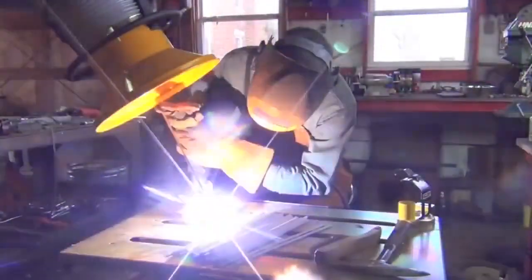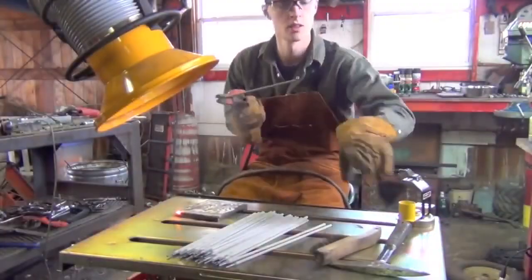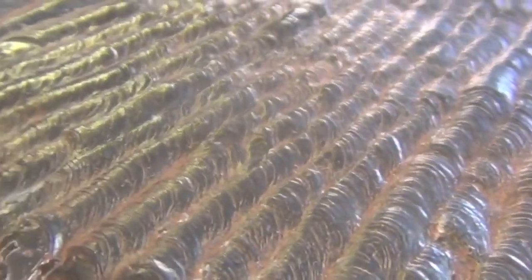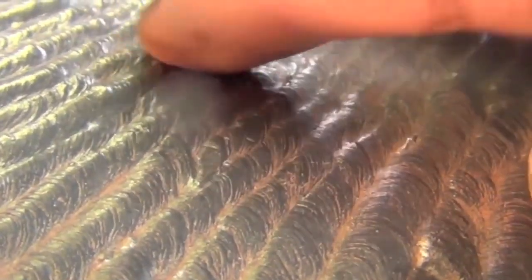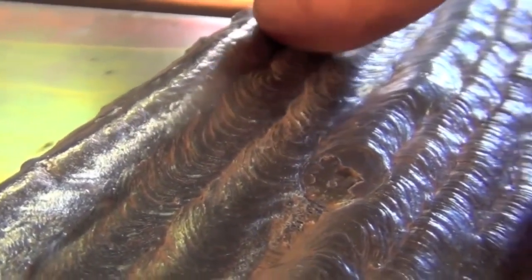Let's do it! So now our nice buttering layer — pad of beads — is finally done. I cleaned it up and let it cool off. If you look over most of this, you'll notice across the top it's all nice and smooth with not a lot of rippling effect, which indicates about the proper amount of overlap. Down here on the other hand is not enough overlap — there's a nice valley in between those beads. Over here you can see this is too much overlap, with one bead pretty much stacked up on top of the other.